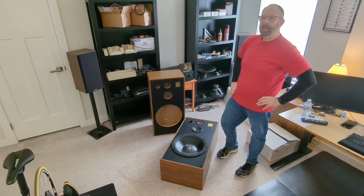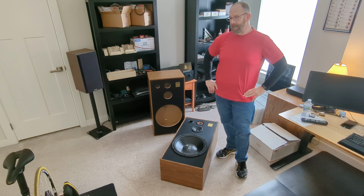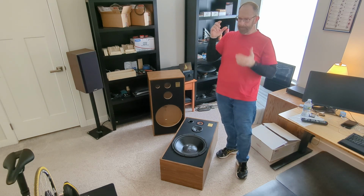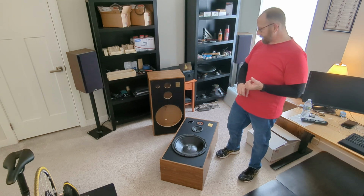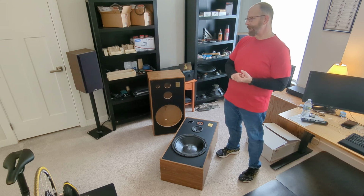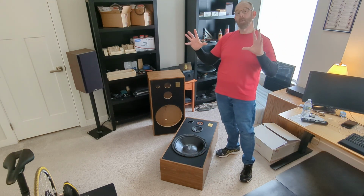It was a high power quasi PA speaker, and it was made out of 13 layer Baltic birch, 5/8 inch I believe it was, and I had a Selenium 15 inch PA woofer in it, and I also had a high power dome horn loaded mid-range in it, tweeter, and then the mid-range similar to this one, tucked away in a horn.